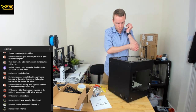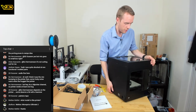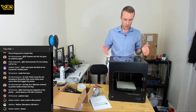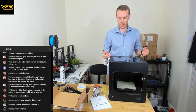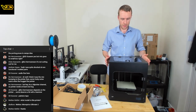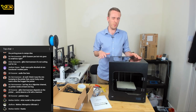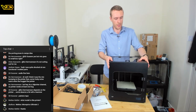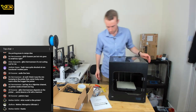So, a couple of you have noticed so far there are some features like the lower temperature hot end that's not really that impressive for the price. But the reason I thought this was interesting is that it has an enclosure, like a proper enclosure. It's a steel solid frame, proper heavy, proper rigid. So while staying at a reasonable price, I mean, 400 is fairly expensive compared to the very cheap printers you can get. But there is some significant cost that goes into a proper frame.